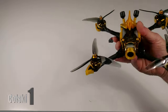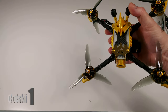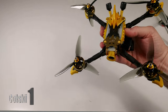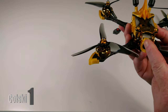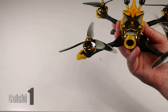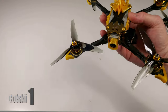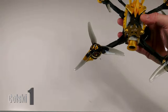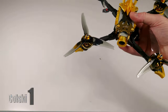It's probably one of the nicest looking quads I've ever had — the TPU is nicely done. The antennas look too short to me; I might swap them out for lollipop antennas to get more height. The lens protector I tend to dremel down to make it shorter so it still protects the lens but doesn't get into shot. This has got props in shot because they're far too close to the camera. I couldn't find a Vista version so I went with the air unit, but the air unit footage does look great.